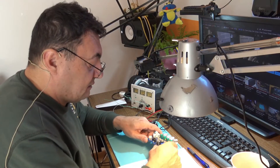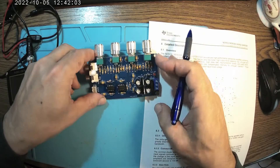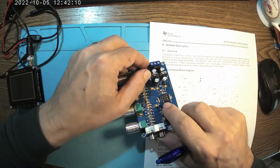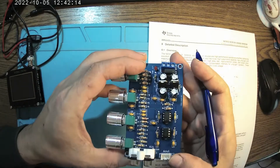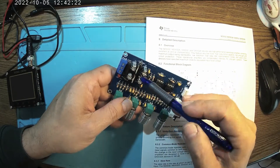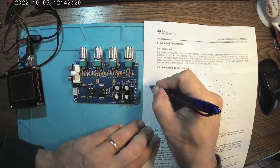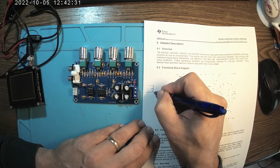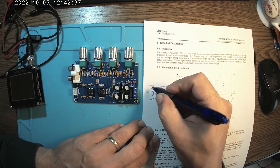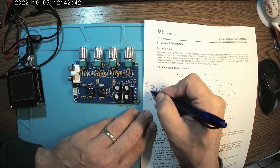As you can see, we have a rectifier bridge and two capacitors, and then we have two linear power supplies — I think they are 7912. So this is 12 volts. All we have to do is apply a transformer with a center tap, 220V or something, and here we have zero and probably 15 — oh, it's too much — 10 volts and 10 volts AC.